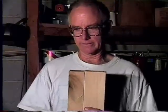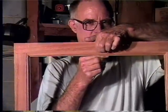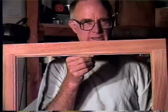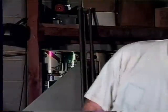And most of your casement, which is the square one, it's flat all the way around. There's no check rail. Most of your casements are just a frame. Usually a 2-inch, and when I'm saying 2-inch, before you get to the milled edge, from this part of the fillet to the top, it's 2-inch. Sides are 2-inch. Bottom is usually 3.5. And the reason they use 3 and 3.5 inch on the bottom is for the crank.